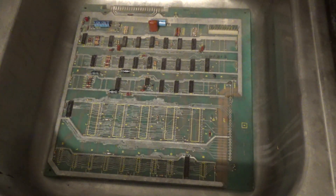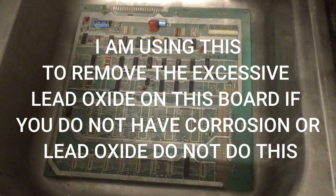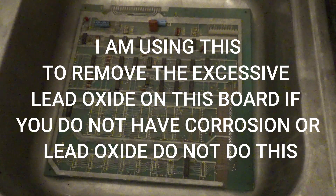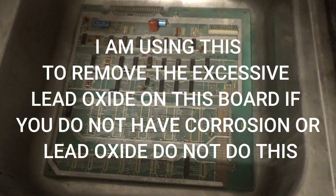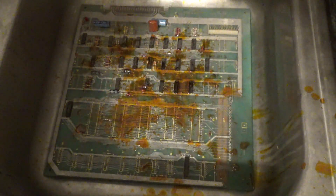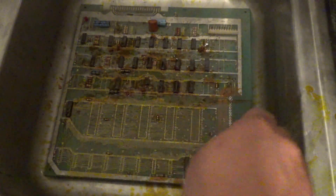What I'm going to do now is dump a little bit of ferric chloride onto this. Ferric chloride is actually what's used for PCB etchant. When they make PCBs in the manufacturing process, they use ferric chloride to eat away the unwanted copper. But what we're going to do is eat a hair into the wanted traces. I'm just going to rub that in with a paintbrush.